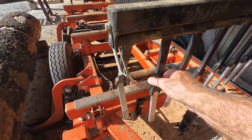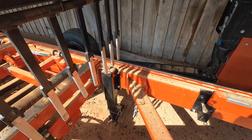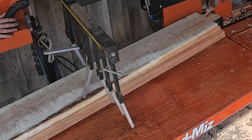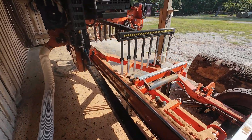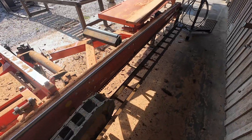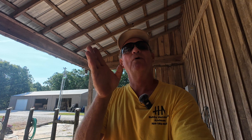These guys are guide fingers. They move forward and backward but do not move sideways. This part of the mill grabs the end of the board and supports it; these keep the board from sliding sideways. Between these two restraints, you've got boards coming back straight. My old LT40 had a drag back but did not have these fingers — that's dangerous. As you're pulling the board back, if it comes back at a funky angle while you're standing right there, the board can hit you in the leg and break your leg. My recommendation: if your sawmill does not have guide fingers to constrain the front of the board, you should buy them or call your manufacturer and have some made.